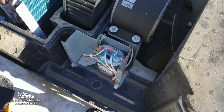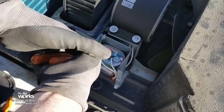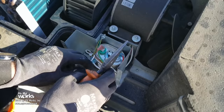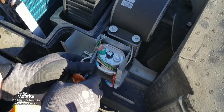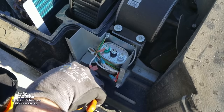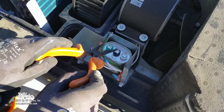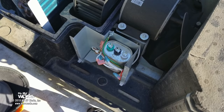This capacitor is a combo unit. All my neutrals are on the center pin, so I'm going to go ahead and pull them off — it doesn't matter which pin they're on. The one on the right is red — right, red, remember that. Then I have one on the left which is brown; he's going to go to the motor. Let me pull him off the top. So now we're all disconnected. Use insulated tools, get the capacitor discharge tool — do as I say, don't do as I do. I'm going to just short these out. They're all shorted out.